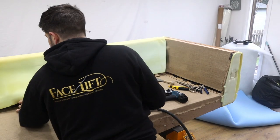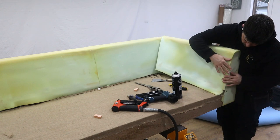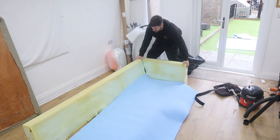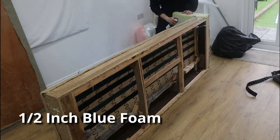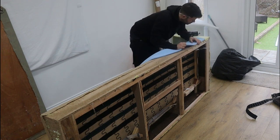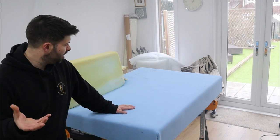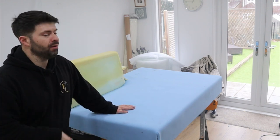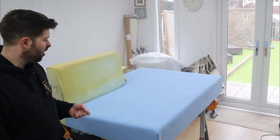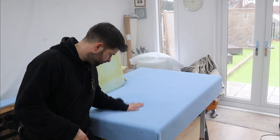What we're doing now is we're pulling the foam back down and replacing the foam on the seat. So — this is how you rebuild a sofa. We stripped all the old fabric off, rewebbed the seats because the webs were really soft, so we've rewebbed the seat. The springs stayed on — the springs are okay — so we've just run new webs in between the springs. Then we've put a layer of hessian over the top to protect the springs from the foam collapsing through.